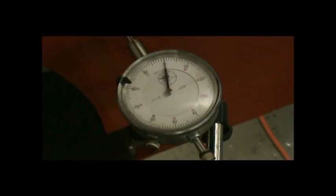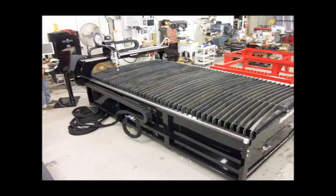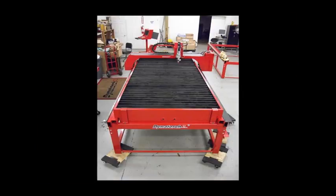That's 1,000th of an inch every time — smooth, solid, and fast. Cheap systems bolt the drives in place requiring backlash when assembled to avoid binding, resulting in sloppy cuts and poor positioning. Our systems are far more accurate than the torch's ability to cut. All Dynatorch gantries are driven from both sides, and yes, it is necessary despite what some will tell you. No amount of angle bracing will stop the shake associated with single-side drive, particularly when cutting at high speeds required for plasma cutting. There are two 400-watt motors driving the gantry that are software-linked. The software always checks them for position comparison and will stop the machine if an error is detected. It costs more to add another motor, gearbox, drive amplifier, and rack, but you do want value, right?